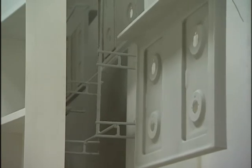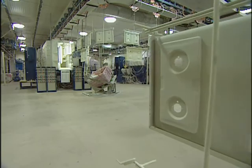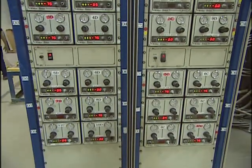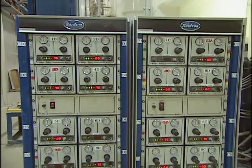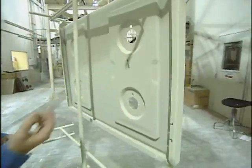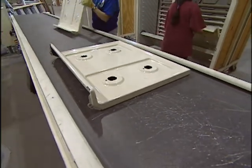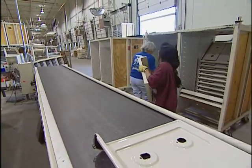then fired, and then the color coat was applied and fired. This system allows two coats to be applied with only one firing. The process is controlled by a panel of instruments that precisely regulates the amount of electrical charge and controls the flow rate of the powder. Now the only thing holding that porcelain powder on right now is static electricity. Now it goes in the kiln where it's fired up at 1500 degrees and that'll seal it on there permanently. Minutes later, the range tops come out with super strong baked-on porcelain glaze that will hold up for years.